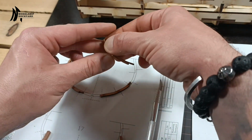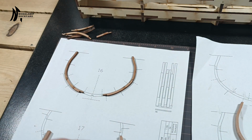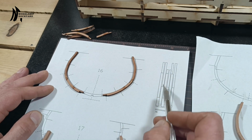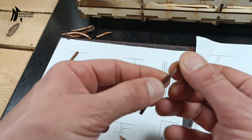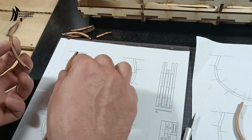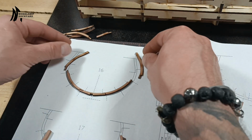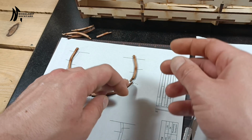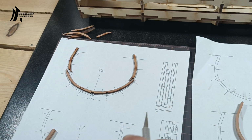After gluing these parts, guys, sorry, like this, we already have this side flat, right? So we have one side already flat. Then we have here, after gluing, that variation in thickness. We're going to flip them over, switch the sides, right, and then glue this part. Right here, this piece is going to be higher. So when you're going to glue it in this order, we will recreate this variation in thickness.